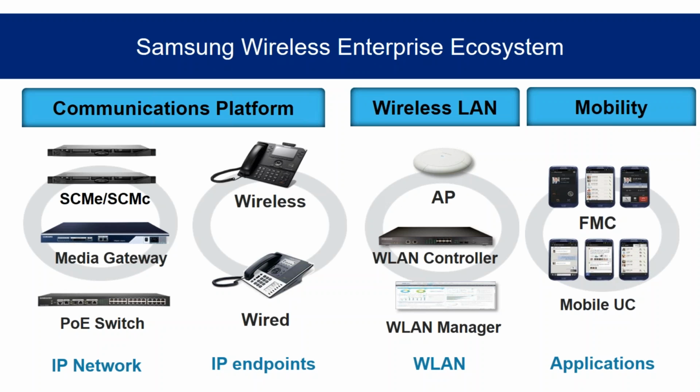The wireless LAN product portfolio includes different flavors of access points, which include your legacy ABGN access point, and then the latest and greatest AC Wave 2 access point, which supports multi-user MIMO and 4x4 capability and all that good stuff. We are about to launch our IoT access point, which, along with the 2.4 and 5 gigahertz radios, also supports additional sensors like Bluetooth Low Energy beacon, as well as Zigbee and Z-Wave.